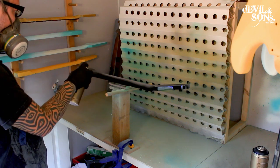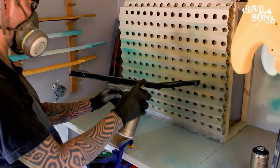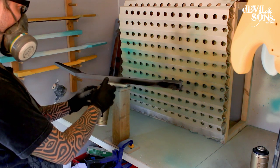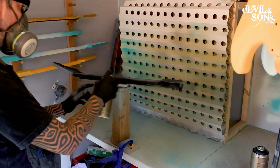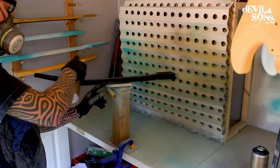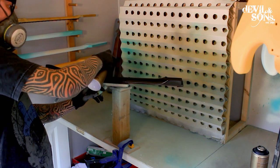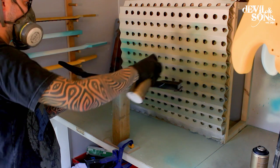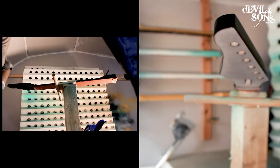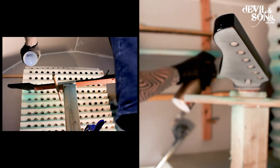The colour I'm using here is a Montana Gold spray can. I've got a video about Montana Gold because I think it's a really good range of paints — there are so many different colours and they work really well on guitars because you can poly or nitro over the top and it doesn't seem to affect the paint, at least on all the makes and brands of top coat that I've used. Plus there's just such a great range of colours. What I'm doing here essentially is putting on three layers, leaving 10 minutes between each layer for it to dry.